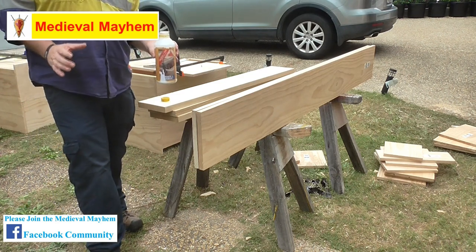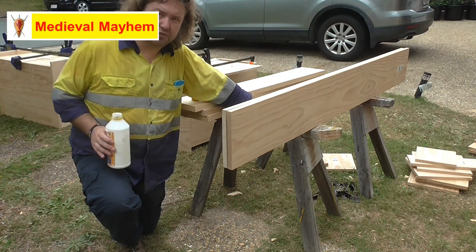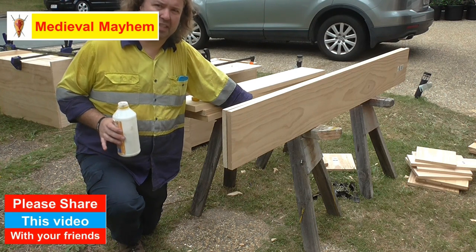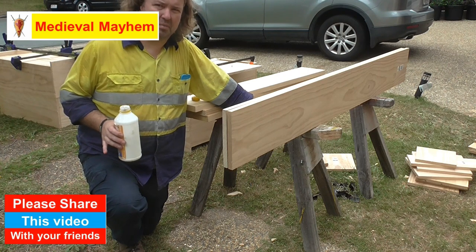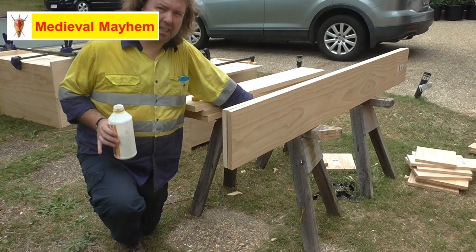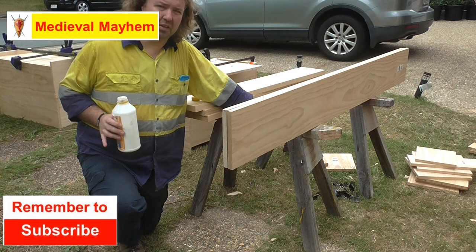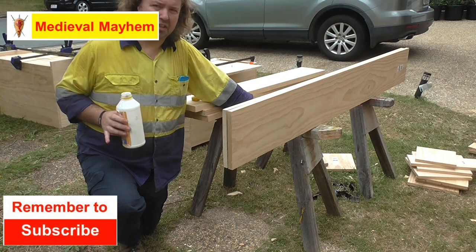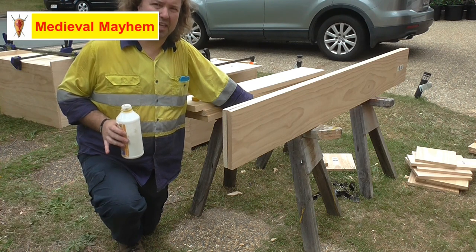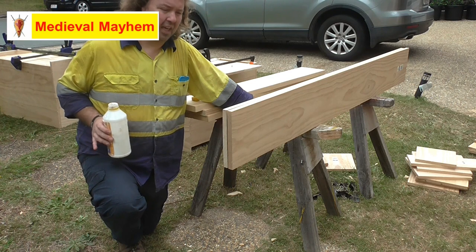One very important part that I'll mention right now. It is actually really important to understand, guys, that I know a lot of you really like to make all your chests and your furniture out of oak. Oak has a very high amount of tannic acid in it. What that means is it creates the tannin process, which you may have heard of. Also the same in some of the eucalypt trees and so on, but more so with oak. And what that does is it causes iron to rust. What that means is that if you make one of these fabulous Oseberg type chests, all of your medieval gear that goes inside it, your sacks, your knife, your sword, your cloak clasps and all that kind of gear will rust. And it only takes a few weeks to do because of this high amount of tannic acid. I really like pine for that reason. It's very low in tannic acid. It's very easy to work with. And it gives you such a great finish.